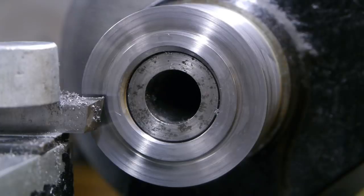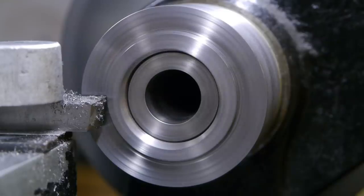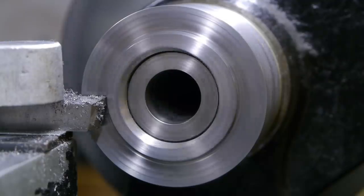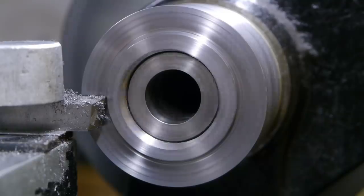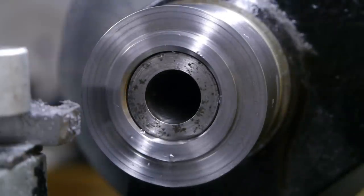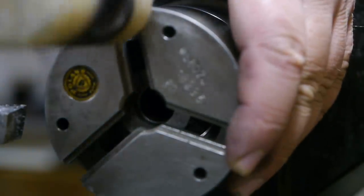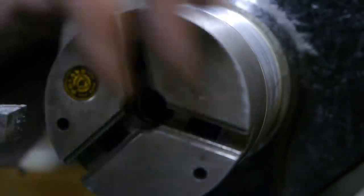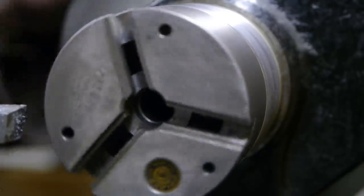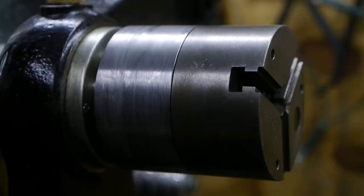I'm getting desperate here. I very carefully lined up the cutter with the register. So here we go. Some material is coming off. It's very little. Here we go again. Well, that has helped. It goes on actually. It still is nice and tight, so I didn't remove too much material. Finally! I cannot get it off anymore. So that's a tight-fitting register.